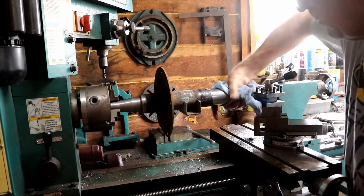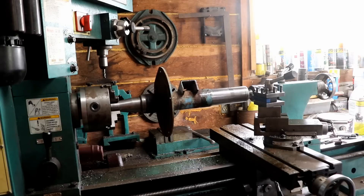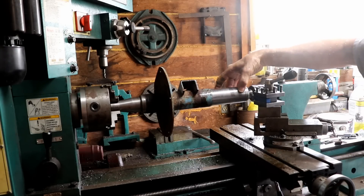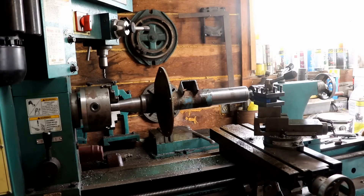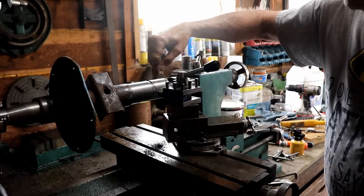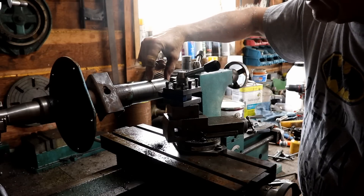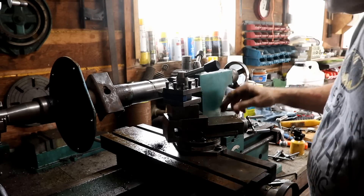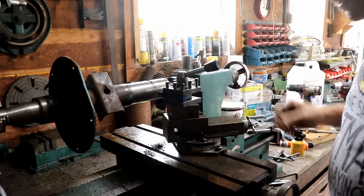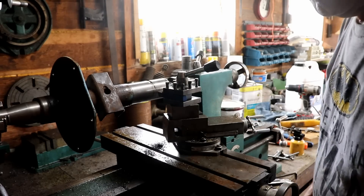I don't know why it's such a bad finish — it just is. I don't know just what the problem is. This lathe sometimes is pretty good, but sometimes I get inconsistent results. I'm not sure if that's going to fit in there now or not — it wouldn't go in there even after it cooled off. This end was still too large. I skimmed about ten thousandths off this end. Hopefully that's going to make it work. Off camera I did a test fit, and it fits up to about right here, then it doesn't go. So I'm just going to try to take some more off back this way. I know I must be turning a slight taper — I tried to adjust this, and I'm going to have to take time and adjust this and maybe get where I'm not turning a taper at all, but right now I'm not going to worry about that. I'm just going to take a little more off this end here.